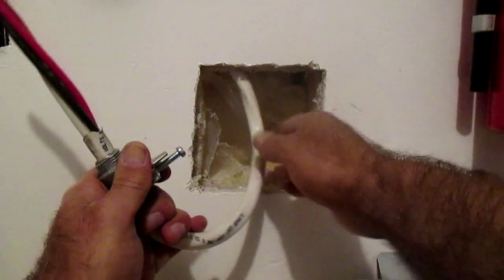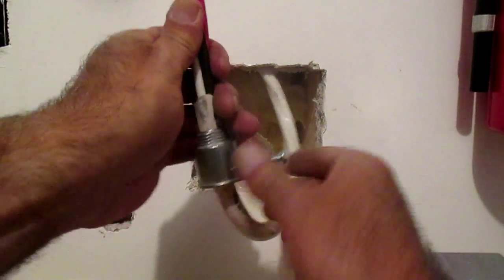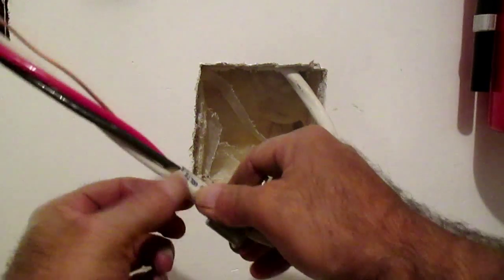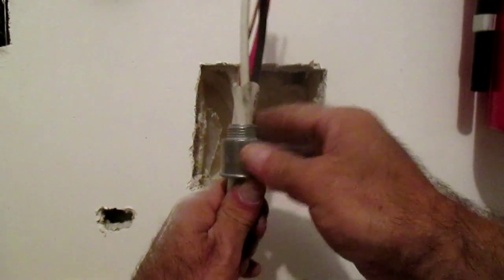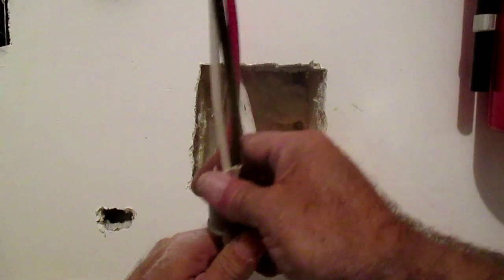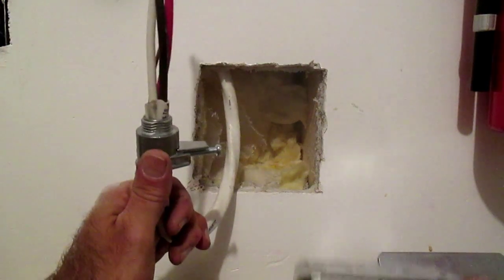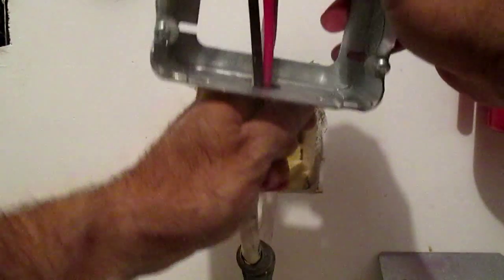I've run my heavy gauge wire for the stove over to where the stove is going to be installed. What you want to do is strip back the insulation on your cable — I probably stripped back a little bit too much there. And you want to put a cable connector over the insulated part down here. I have the three wires and the ground wire exposed up here. Have a gang box like that, punch out a hole in the bottom — ideally you want the wires to come through the bottom, not a big deal if you have to run them through the side. Then basically make this up — the cable through your gang box like so.